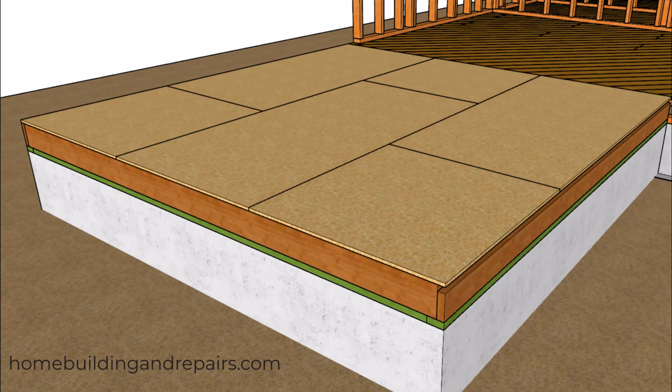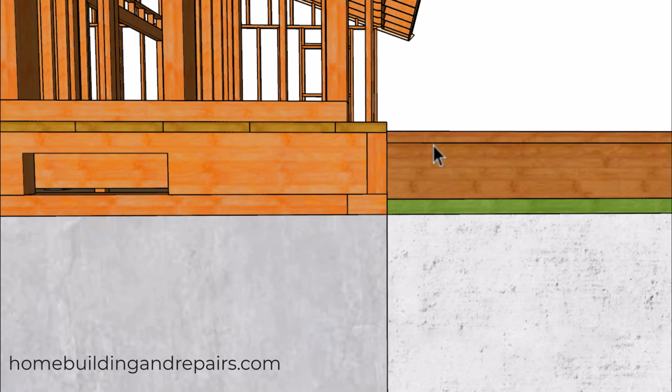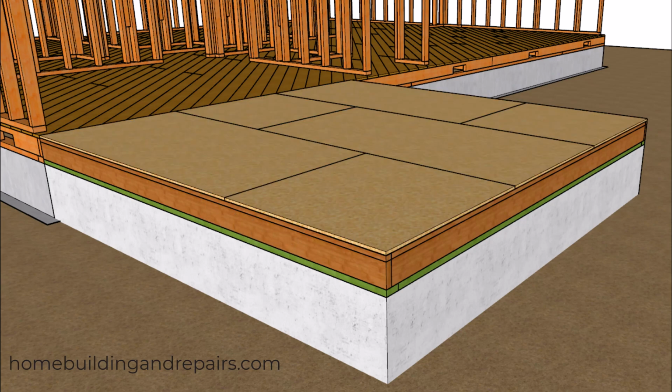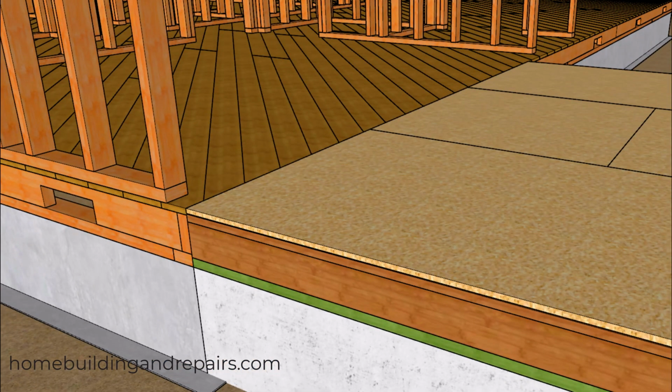And the last option I am going to point out is the one that I already mentioned with the rip strip on top. You would just simply nail a shaped board to the top of the joist to raise the height that you need to make the floor level. And if I did my job correctly, then you now have a few more ideas you can put into your home remodeling old house room addition toolbox.